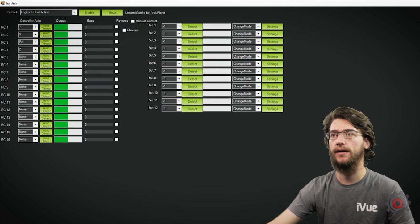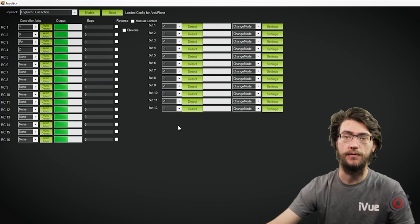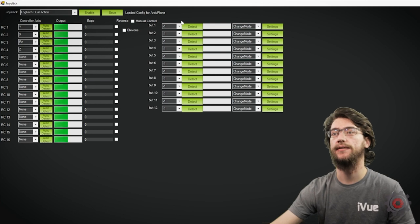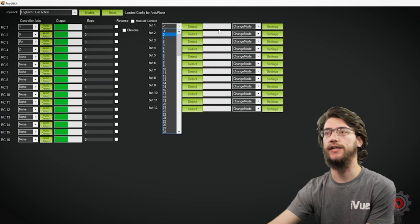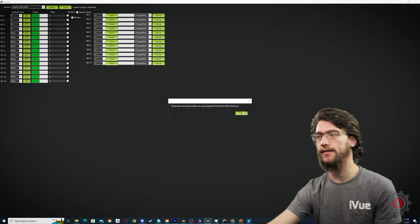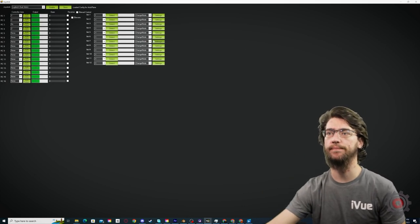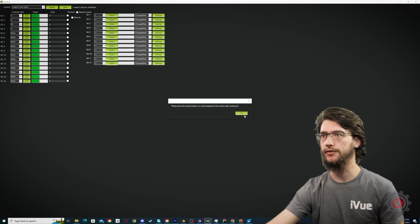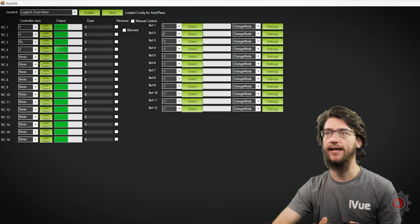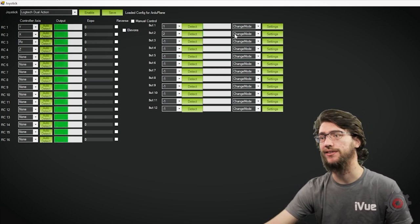Go to maximize to see better. On the right side you'll have all the buttons; on the left you can see the four RC channels from the last video still saved. All we're interested in for controlling the dispenser mod kit — and really any servo or similar mod kit — is these buttons. So first we'll assign the channels to specific ones on the controller: hit Detect, hit OK, and then press a button on the controller and you'll see it syncs up with what's on the screen. We're going to do that for button one and button two, assigning these to A and B on the controller. Once that's done you can see these are synced up, but they won't actually do anything yet.